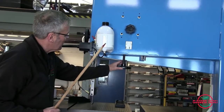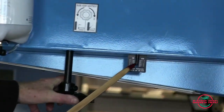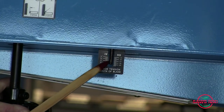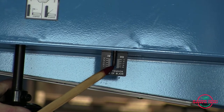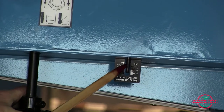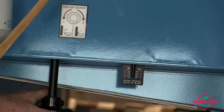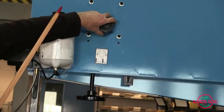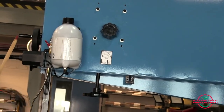The blade tension is applied here as you would see with most vertical bandsaws. There is a gauge here for different tensions for different widths of blades. If you have a very wide blade — say an inch blade for cutting solids — then you would wind this up tighter. If you've got a very narrow blade, say six millimetres for cutting round circles, then you need a lot less tension. There is also a means of getting the tracking right on the bandsaw wheel with this knob here, so you can set the guides up for the narrow blade.